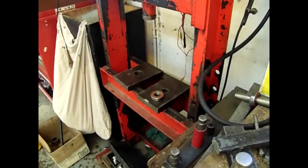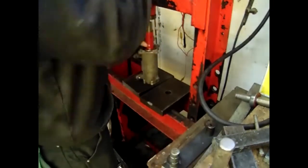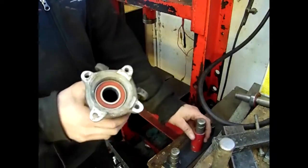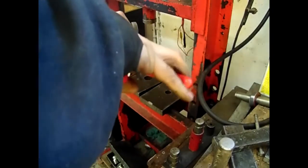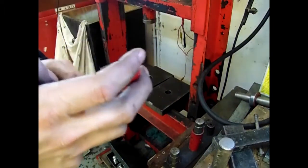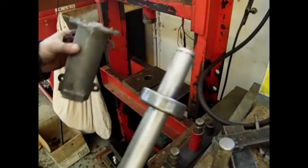With all parts cleaned and inspected, we can now begin the reassembly process. Press the rear bearings into place until it is seated. Secure with large snap ring. Press the front bearings on the shaft until it is seated against the small snap ring.